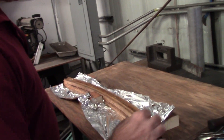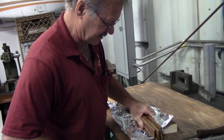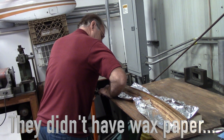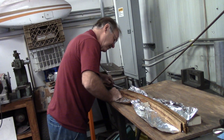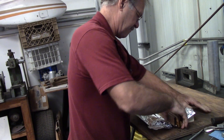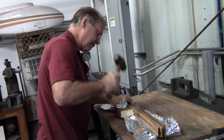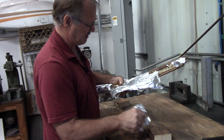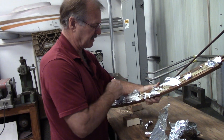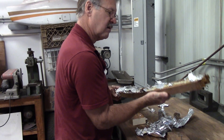We've taken the clamps off the laminate and we're going to take it out of the mold now and see how it looks. It's probably adhered in a few places. We put the foil there so it wouldn't glue to the form — looks like it did anyway. It's just tight inside the form. There's still wet glue on the bottom because it wasn't exposed to air. So we'll let this sit. I think it's going to hold — it's got the curve to it.